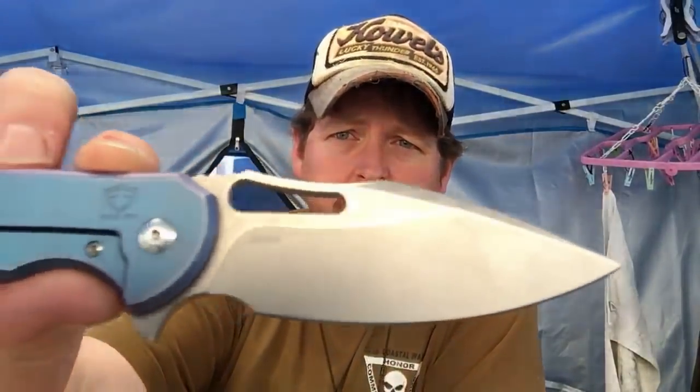The WE knives, the S35VN, like what's going to be in the Pro line, they do their S35VN a good bit harder, and it's great. It's awesome, and it's still fairly easy to sharpen. So there are different heat treats. I can definitely feel the difference on a stone between Elliott's knives that are in 20CV, like this, versus the knives that I make in the same 20CV with Elliott's in-house heat treat recipe. Way different, because you can't get people to do the heat treat on 20CV the way Elliott does and still be able to do any grinding without burning stuff up. So they went with a different heat treat process, a couple points lower. D2 to sharpen, I like sharpening D2. It's fairly straightforward. It takes a really sick edge.